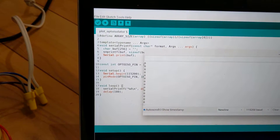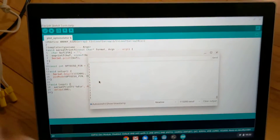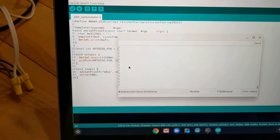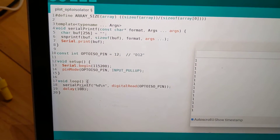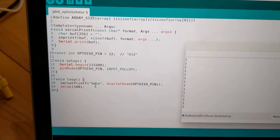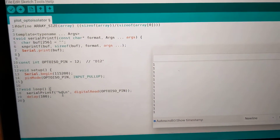As long as I hold it solid, it's fine. But if I were to read it faster, I could probably catch the points where the AC is actually zero volts. So you can't just treat it as totally digital. I'm planning to run this at a faster sample rate and see if I can see the 60 Hz waveform. But the point is, this is a certainly viable way to read a 24-volt thermostat input on a microcontroller.